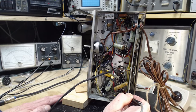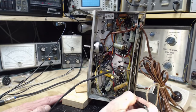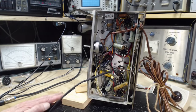Now there's a screen in here too. Oh, here's more voltage, much lower, 77. That's probably the screen. Now, so we found 2 high voltages on this tube. That's good. One of these should make the tube go backwards, or make the meter go backwards. That one. That one makes the meter go backwards just a tiny amount.